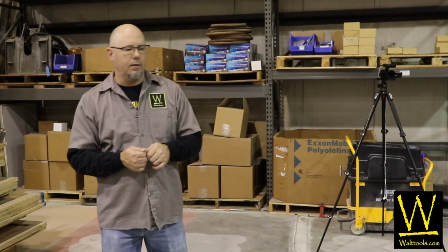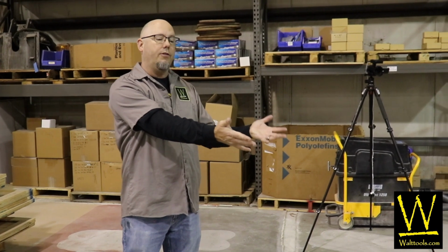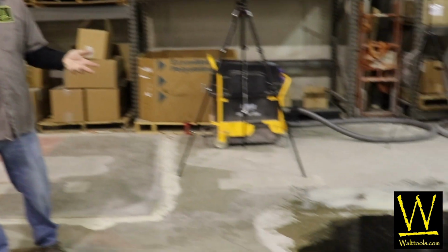So in this case, this is black. If we decide we're going to use a white primer, we'd have to have so much resin in there and make sure that this is painted so you can't see through it. And then, because your quartz layer is so thin, any missing spots you see in your quartz are going to shadow through. So again, the hardest part is getting everything as even as possible. So just know what your background color is. If you're starting with a dark, you're going to want to make sure your broadcast media is also fairly dark. That's all.